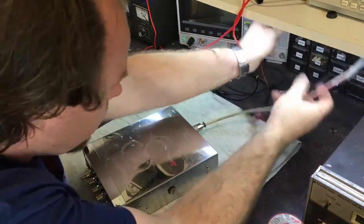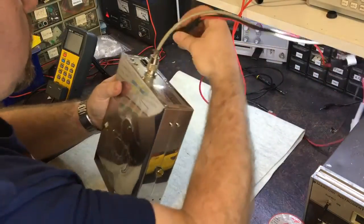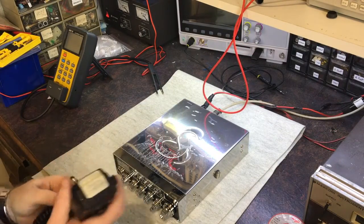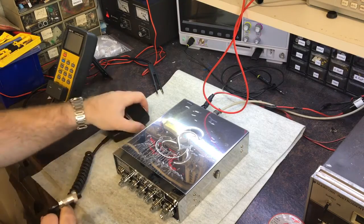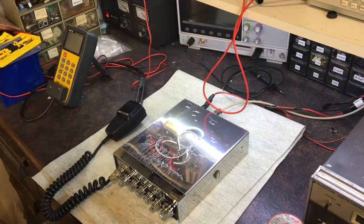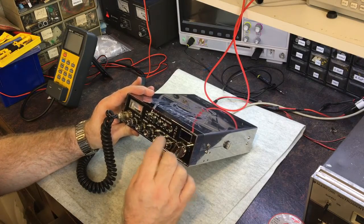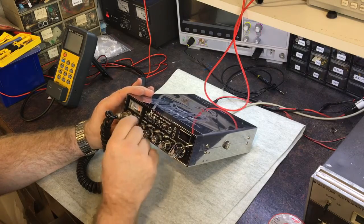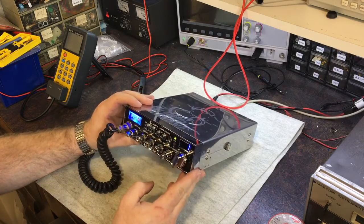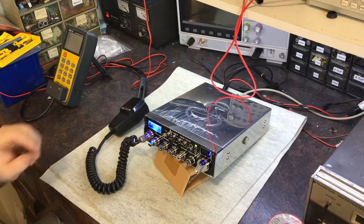Tangled wires. Right. Power wire. I'll use my own microphone. I always use my own one because I know what it sounds like. I know if it sounds wrong. Monitoring radio is on, power's on there, voltage is okay. Preset controls, mic, RF gain, delta tune center, talkback, don't want that, swap out, that on, that off, squelch down, right. Blue. Okay. Hopefully you can see it okay.